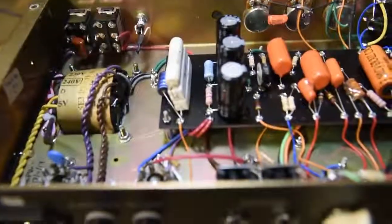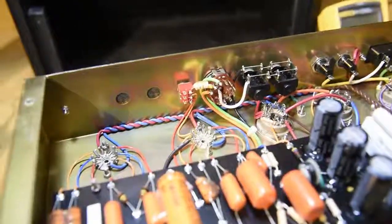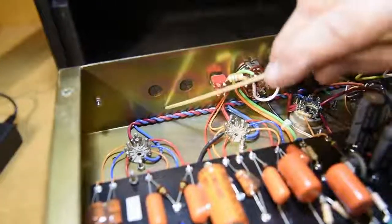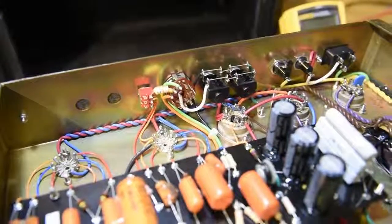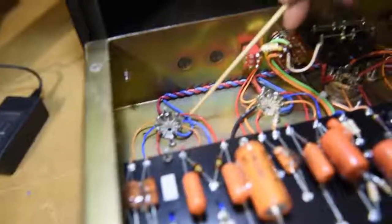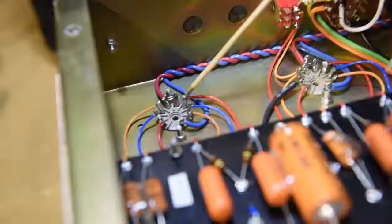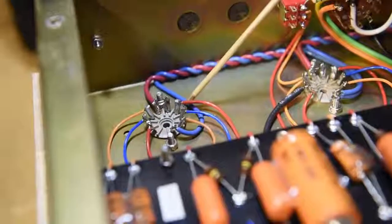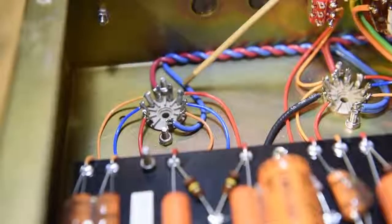Start on the wiring. The wiring, as you can see, is meticulously laid out everywhere in the amplifier. Certain things bear close observation. For example, the 6.3 volt filament wiring is kept far away from everything else, put into a corner where it's less likely to cause interference. Anywhere these high quality, less noise, nylon insulated wires go past the 6.3 volt filament wiring, they do so at a 90-degree angle. This eliminates the possibility of interference traveling from the filament wiring into any of the signal carrying leads.